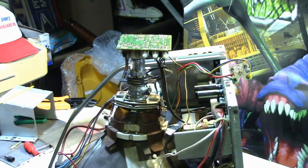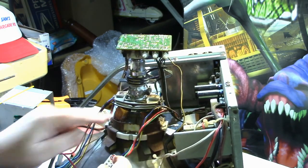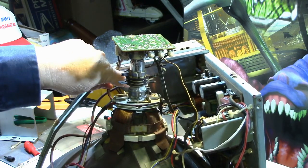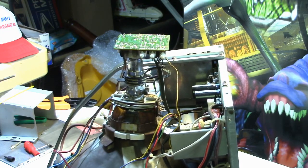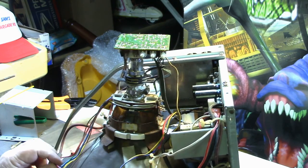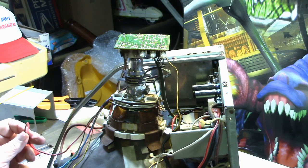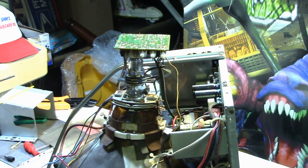Okay. Now, what I'm going to do, just until I see if it works, like I say, I already plugged in the original yoke plug because it's way down in the monitor behind the high voltage transformer between that and the heat sink for the hot. And it's very difficult to get in there, so I actually put it in before I mounted the board back to the chassis, or back to the tube. Okay, so now all we have to do is match up these wires, because the color code is the same, because I took the ohm readings. So this should be not too bad here.